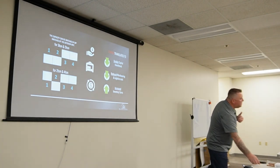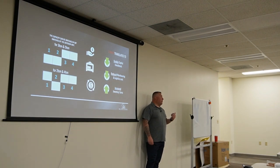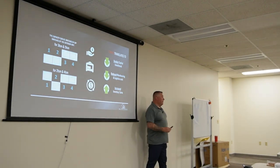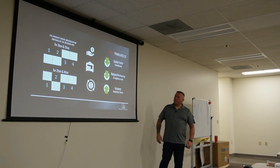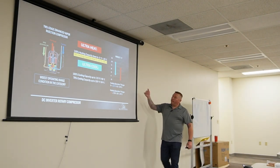My own house is about 600 square feet — a one-bedroom ranch with no basement — and the previous owner put a 2-ton air conditioner in it. It took me about eight months to get the moisture off the windows because the unit was oversized. I replaced it with a heat pump and the problem is gone because I can slow things down with the inverter. If you oversize it you will run into moisture problems.